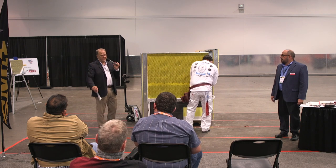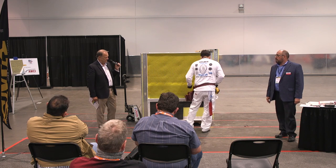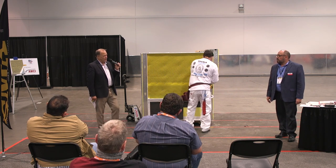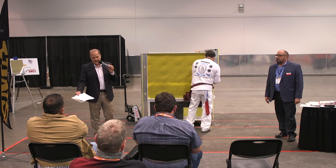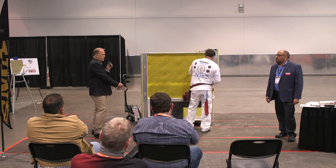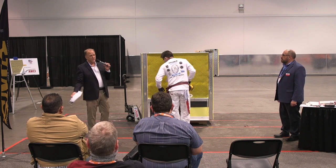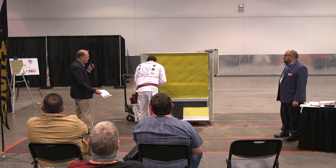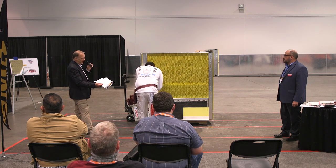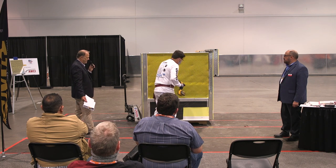If you look at the mock-ups we have around here, that's exactly what we try to demonstrate. About the SMA training program — we try to teach the guys out in the field to pay attention to the laps, to make sure you're lapping things like shingles on a roof. You don't put them on upside down. If you shingle it, layer it out, and allow it to drain out somewhere, you're going to be in good shape.